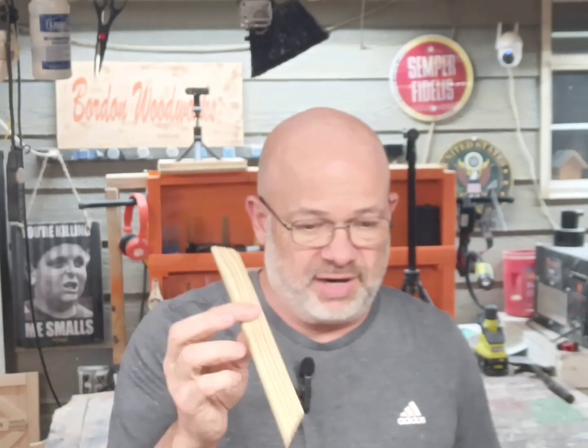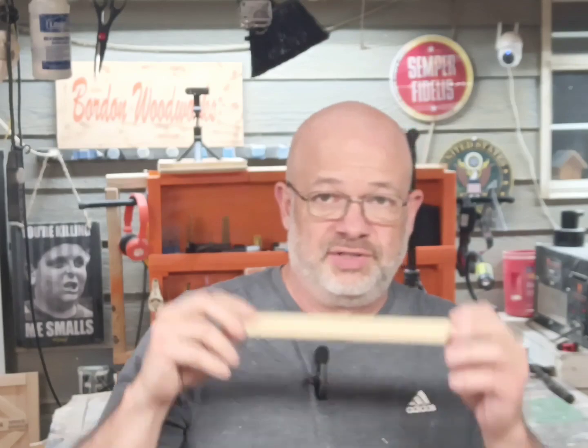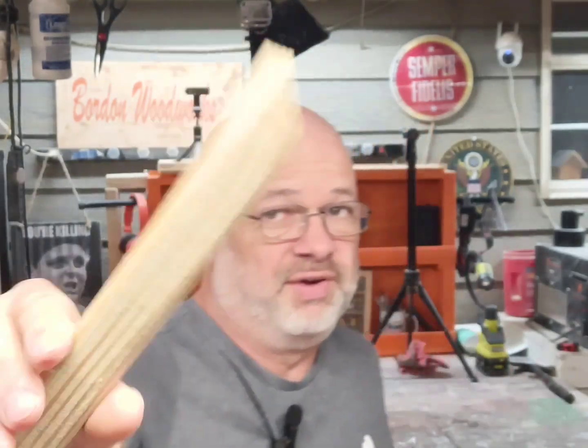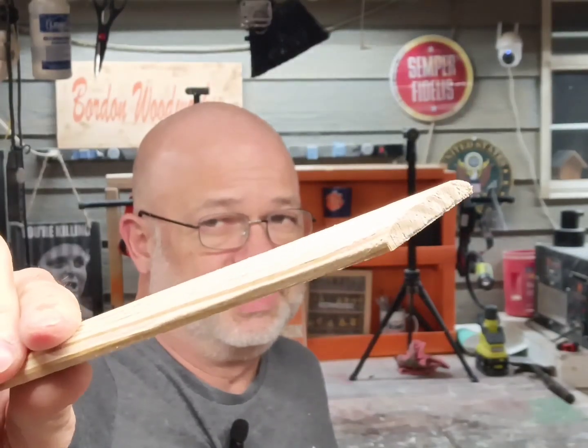It took a long time to do that, which was 14 doors. When I was cutting these and running the edges, as I was cutting the board, it would be square. So what I did was I took them to my belt sander and just rounded them over on the sander and made the round edges just like that right there. You can see the round part. I made all the other edges rounded over, and then I just framed them together.